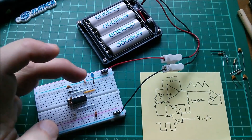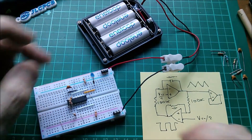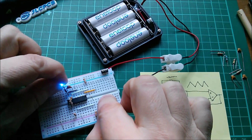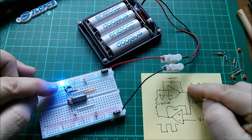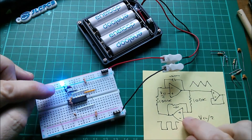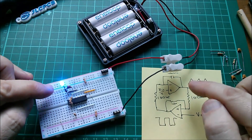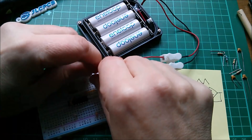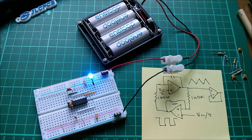This doesn't only work because I've got the buffer amplifier preventing loading, because if I take the LED out and strap it directly across the output — still works with the LED tied directly to the output of the non-inverting op-amp. It's just that the buffer presents no effective load, so I will use the buffer. Intriguing and weird configuration of a flashing LED using op-amps.